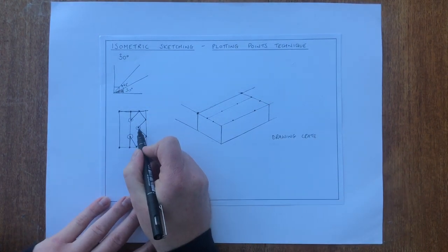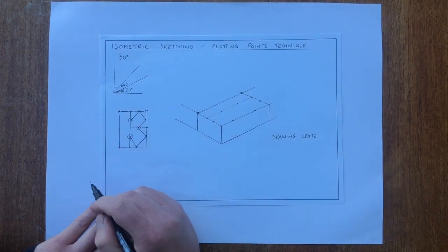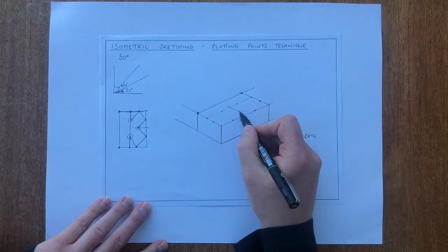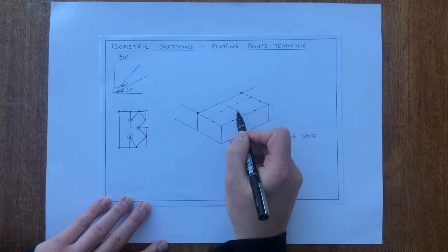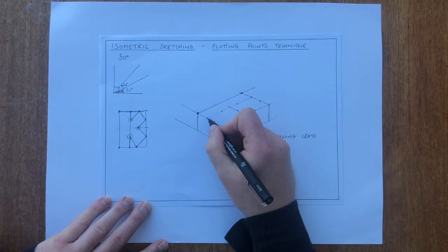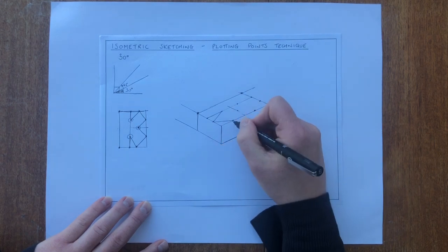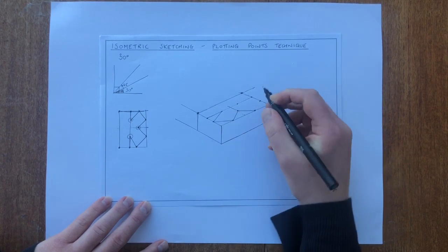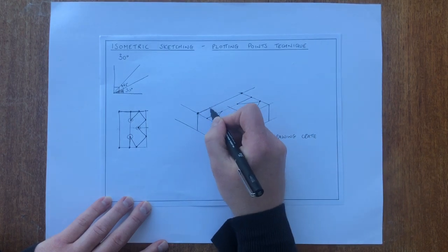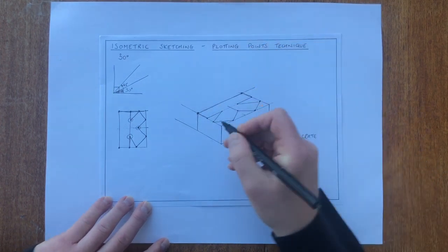The last points are more challenging to find. If I look at these first two points and draw a straight line down, all four points are on the same line. So I'll draw a light line between those two points, and on that line these two points will be found — one is about one third of the way up, and the other about one third of the way down. The last point is around about halfway up, so I come along the edge halfway, draw a line across at an angle, and that point comes in to about here. Let's then join the dots up on the top surface. If I just darken it in slightly, you'll see the K shape drawn on the top surface.